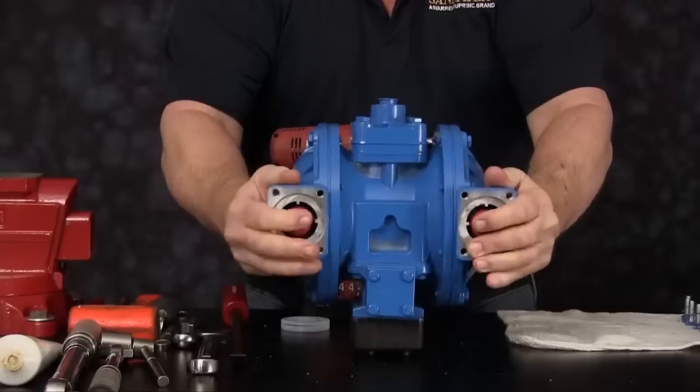We are now ready to install our wet end kit. Remove the diaphragms, check balls and seats from the package. Inspect the inner and outer diaphragm plates. Ensure the plates have no sharp edges or scarring on the radius. Plates can be cleaned up with emery paper, crocus cloth or fine sandpaper. Make sure the radius is maintained during cleanup. Replace if necessary. Install a light coating of grease around the inner sealing bead area as well as the outer sealing bead area. The side that says 'install this side out' has the natural bulge of the diaphragm out — that usually goes towards the product side. Slide the diaphragm down onto the stud of the outer diaphragm plate. Install the inner diaphragm plate with the rounded edge towards the diaphragm. Install the diaphragm bumper onto the diaphragm rod and thread onto the stud of the outer diaphragm plate.